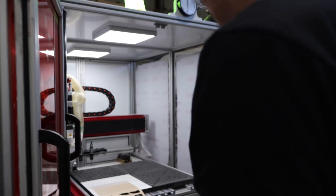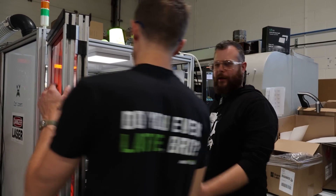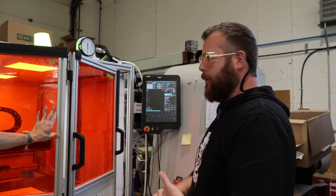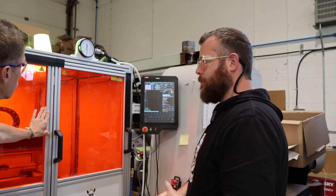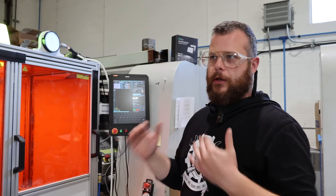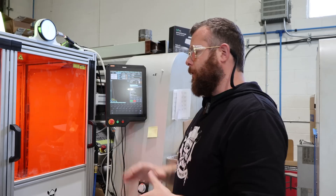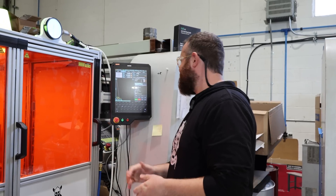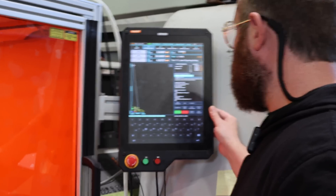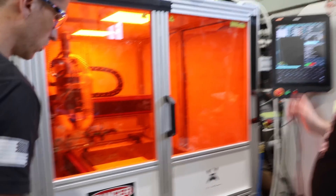I haven't even seen this burn tape yet. You should probably do a video in the future about how it all works in here — we're doing the bulk of our packaging, all our foam is done in here, lasering the logos, and now this. So it's ready to go. We're doing three passes at specific power and speed settings and we'll keep dialing that in until we see the least amount of sparking off of the paper. It's 45% power at 40 inches a minute. Seems pretty zippy.